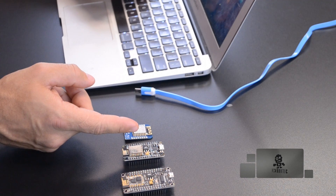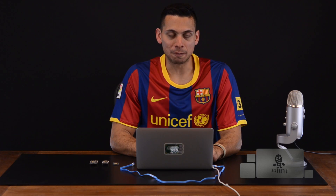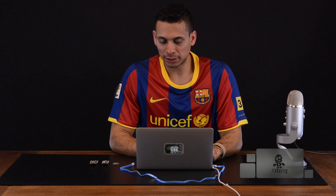The next thing we'll need to do is install USB drivers so that your computer can communicate with the D1 Mini development board. This is a potential pitfall for new users because those drivers depend on the actual board you're using. In our case we need to find the drivers for a chip called the CH340G, whereas if we were using the NodeMCU dev kit we would need a different set of USB drivers. Using the link provided in the description, go ahead and download and unzip the file.